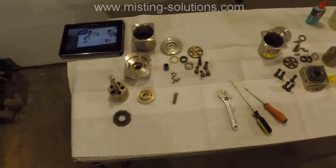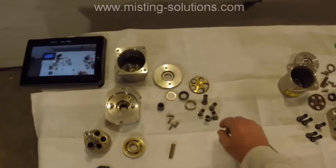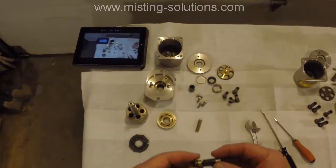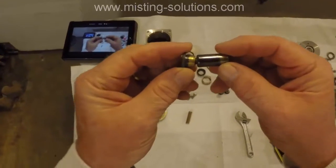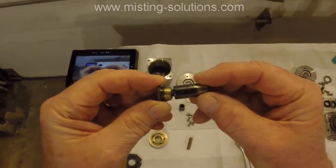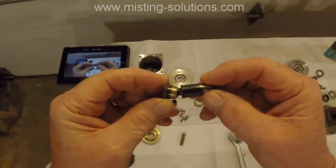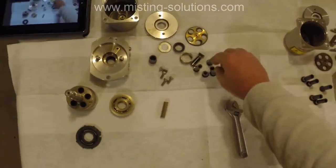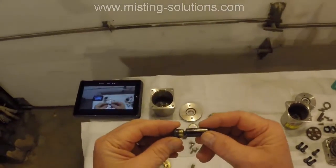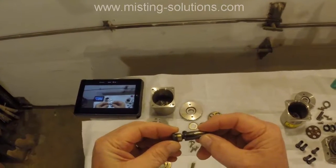that is involved in the movie that I made for training. And really this one, all the pistons are loose. And you can see here I can wobble this shoe here, and that's not good. That's what was making all the noise on this. And again, it has 17,000 hours. That one was the worst, but all of them have a little bit of wobble in the shoe.